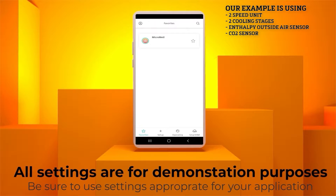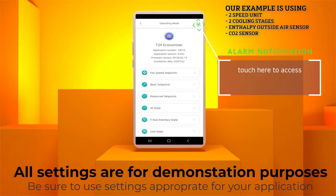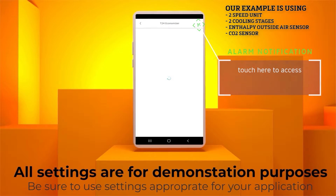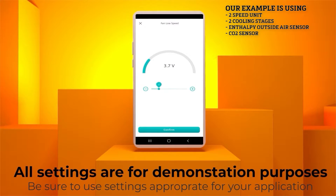Go back to the Operating menu icon at the bottom of the page, and then hit Begin Operating. This time you will be presented with additional setup options. You can click on the button at the top right of the screen and review alarm notifications, including sensor fault alarms. Now click the Fan Speed Set Points. We have already shown how to set the minimum position set points if you do not have a CO2 sensor. If desired, the minimum position set points can be adjusted on this screen also. This is also where we will set the power exhaust activation set points when applicable.